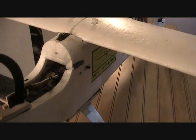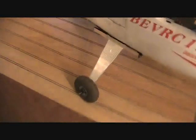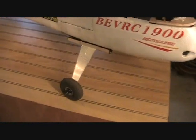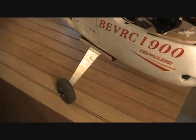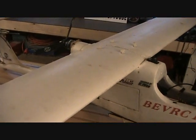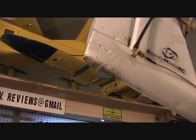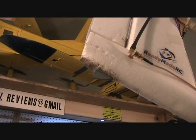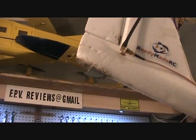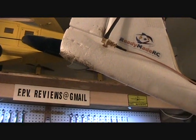The Skywalker has one drawback — it doesn't come with landing gear. A lot of people just put on their own landing gear. In this case I bought a set of landing gear and just put some wheels on it, and I have it temporarily affixed to the bottom of the fuselage. I also noticed the tail of my Skywalker was getting soiled and worn off plainly. So I installed a little tail skid off of another foam model on the tail to keep the tail from getting worn away during landing and take off.